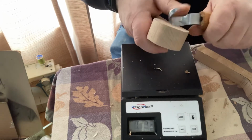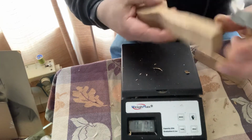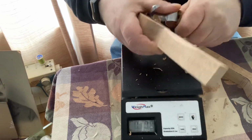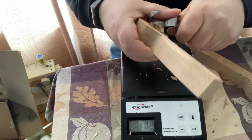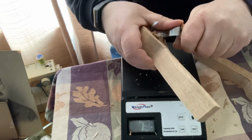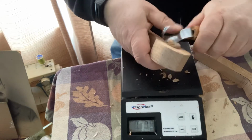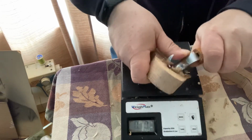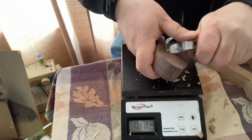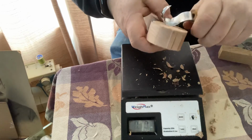And basswood is another choice. Now, I have in the past done birch. Birch is as hard as walnut and cherry, pretty close. But I don't see that it's particularly beautiful, and I don't think it's worth the effort. There are thousands of kinds of maples, but most of them are just too hard. Some of them have very pretty grain, not all of them. And I think really for investing your time in making a spoon, butternut, walnut, and cherry are your best bets.